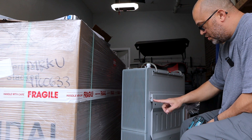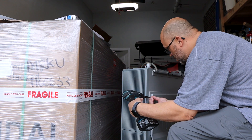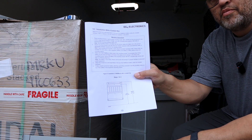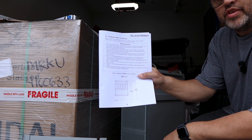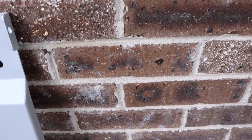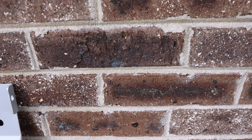The bracket on the back has four screws holding it on. The top of this thing needs to be 28.06 inches from the ground for it to be mounted against the wall and still on the ground. There's the meter right there — got enough room here to mount it. I did some measuring: lined up the center hole, got at a minimum of 28 inches and a sixteenth up, lined up the top of the plate, then marked the middle bottom hole. Going to drill that one hole and get the plate temporarily up there to make sure it's level before marking the other holes.